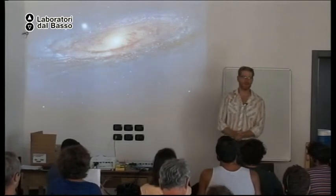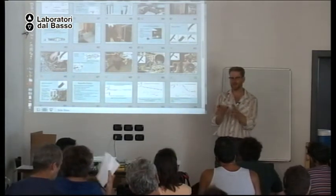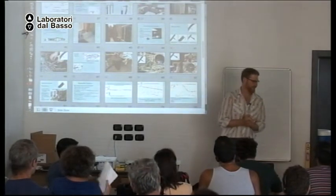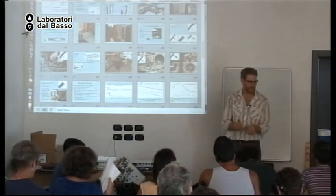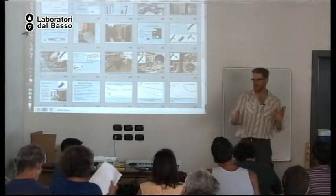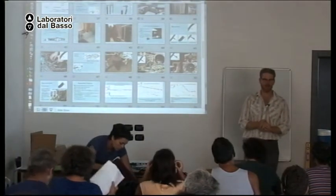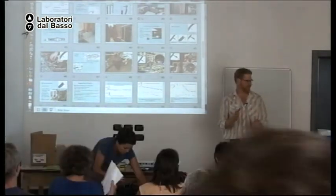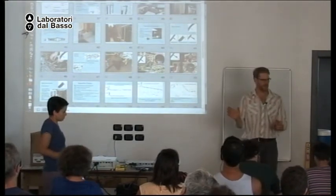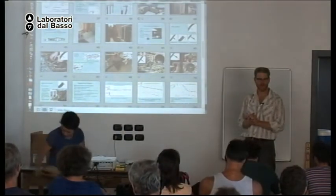After lunch, we will break you up into groups, and you will all, as different groups, assess how much gray water is coming from different sources in the house, if that gray water is accessible or not, and then you will do the percolation test, where you think you want to direct the water in the landscape, and then you will size a basin or chambers or something else large enough to handle the water flow. And we will also discuss how you figure out what that water can irrigate, how many plants you could plant with that water. Okay? So my goal is at the end of today, you can assess any site for its gray water potential and design a system for it. And also know how to build the system.